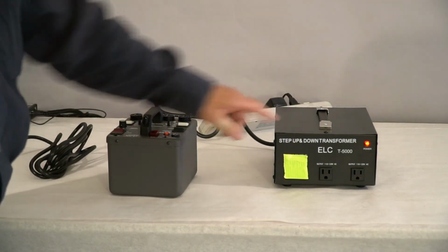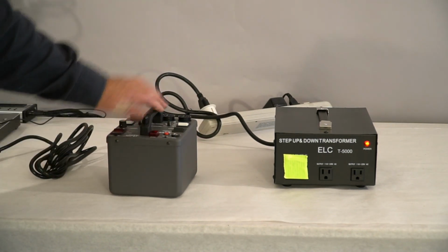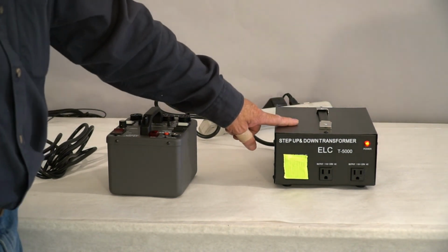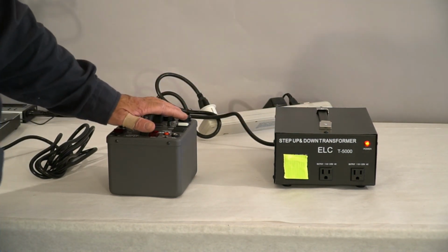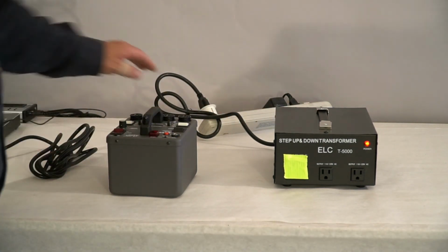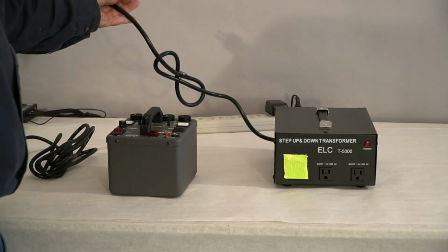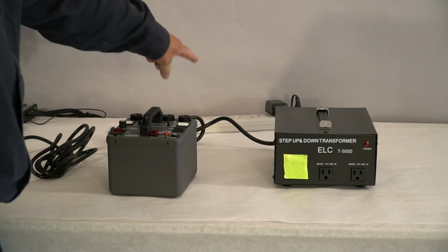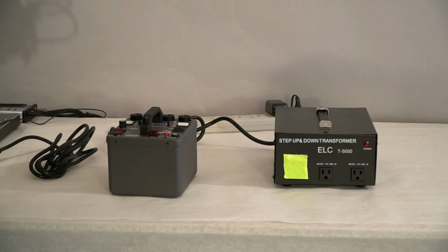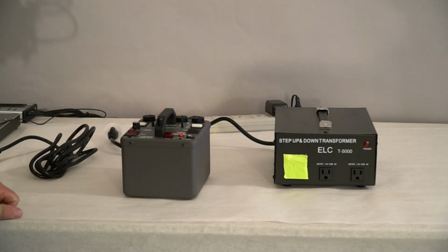We have these all over the world. They're working well. These things draw very little relative to this. This is 5 times more than we need to run this pack. They're CE approved, and it should be very easy. So this, by the way, will not be plugged into the plug strip. This gets plugged into a separate circuit in the mains, preferably one that is not connected onto that plug strip. This should have its own power supply, not connected to the computer, not connected to the camera. This should be independent because this draws the most power of anything.